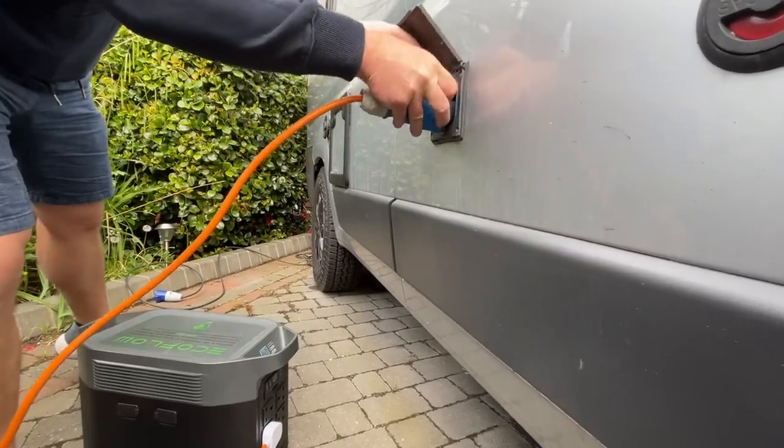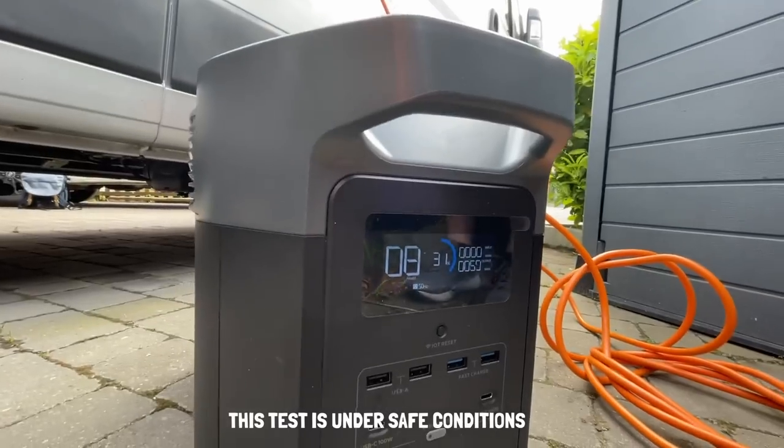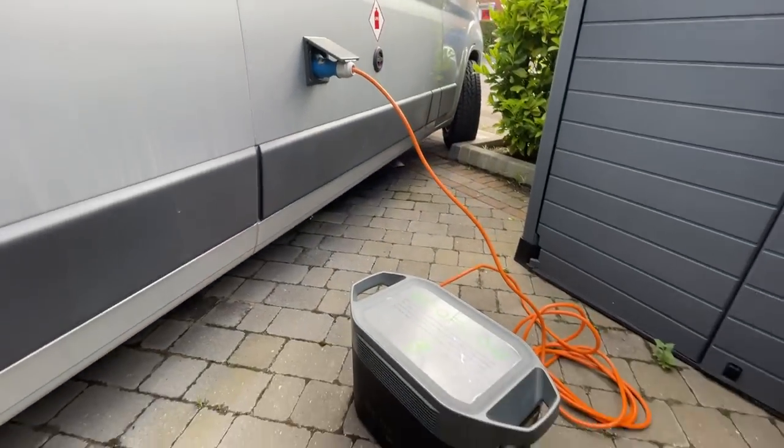You can also charge and discharge this simultaneously, which means you can have solar coming in while all your stuff is plugged in and power going out. My advice with any battery system would be to try to charge everything during the day. The biggest bonus if you've got a pre-built van is that because of that huge inverter, you can plug your van straight into this. Whatever battery setup your van has — even a single 100 amp-hour lead-acid — you can set your solar panels up so the sun is charging this, and at the same time this is charging your van. This is by far the easiest way to get your current factory camper van off grid, because these factory vans are designed for campsites and if you want to modify them you have to start tapping into the Sargent system and all its cables.